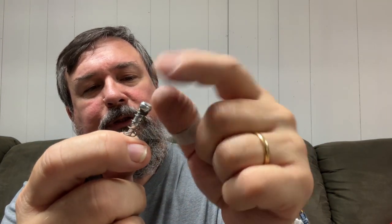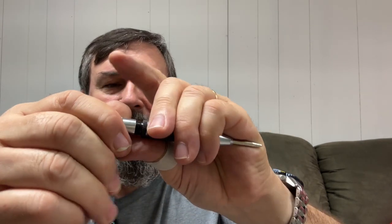Here's the spring and the plunger. So these, it actually loads up when you push down on it, and then it gets to a point and it actually springs back and impacts the tip. Whoops, which I just threw on the floor again. So it impacts the tip and leaves a better mark, which is kind of what you want. Got knurled edges. Let's see, I'm thinking this is your tension for how much pressure. Yeah, that's a big spring in the back. So it's got the big spring in the back here, and you can adjust somewhat the tension on that. So if you're using a softer wood, you want to use a little less tension on there so it doesn't poke right through the wood.